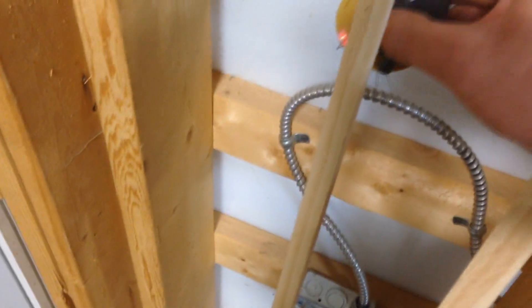It worked fine in the microwave, and you can see the lights are off here. I'm shining this at the wall. This functions as a very, very dim flashlight. But I've never even seen a flashlight that runs any length of time on a 3000 microfarad capacitor, or that can charge as fast as we just charged this thing. Considering that I have not even started tuning this circuit yet and winding the coils to best optimum resonance, I'm very happy with even this amount of performance in this demonstration.